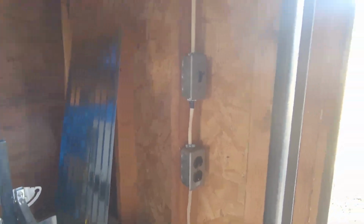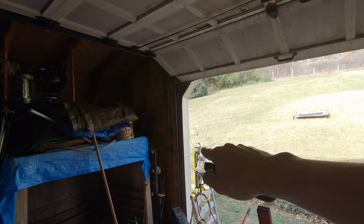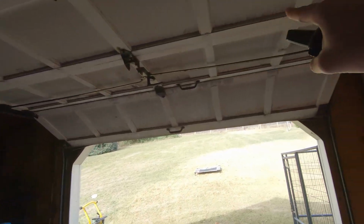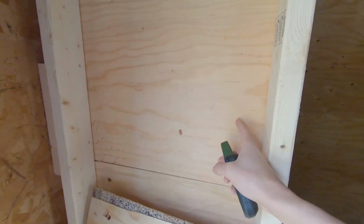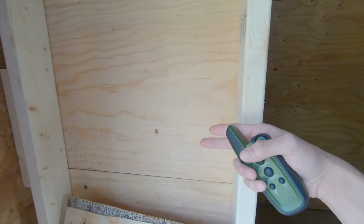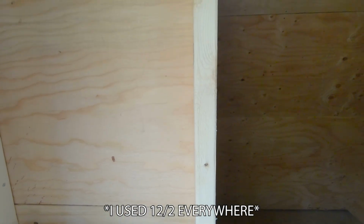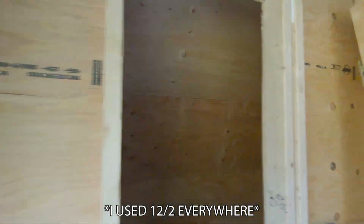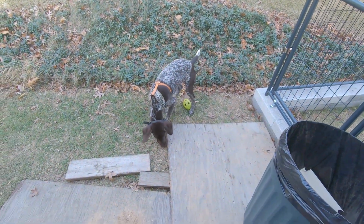All right, so time to start running some electric. Take 12-2 from that outlet, run it up over where the garage is, down to here. Then put a 2 gang box on the inside for 4 plugs. And then on the outside here, I'll use that 14-2 to run to the LEDs inside if Amazon shows up, because they failed delivery yesterday. Right, Goose?